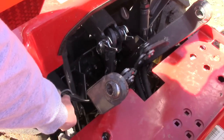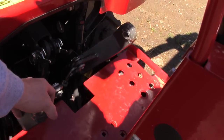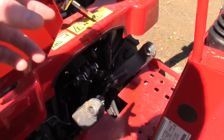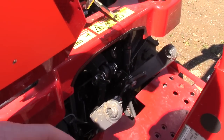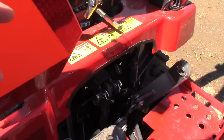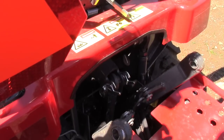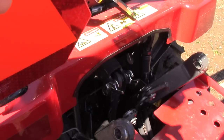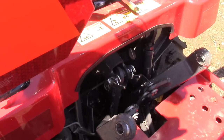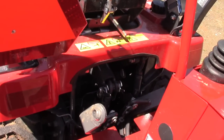It came with a little rubber strap, and it does have a holder for the top link. The hydraulic hoses — you can get the tractor about two feet away from the backhoe attachment, which is really nice for connecting. There are three hoses. My particular tractor came with little color-coded tie straps — I think it was blue and yellow — and there's a matching hose on the other side. The red one gets disconnected and capped off; it does come with caps. It's pretty obvious how those connect whenever you disconnect or reconnect.